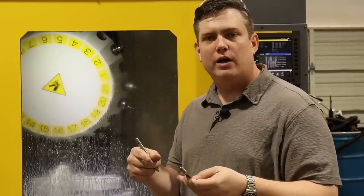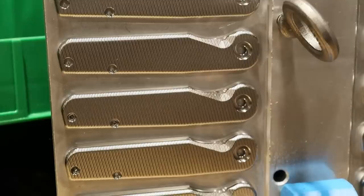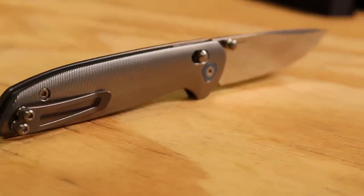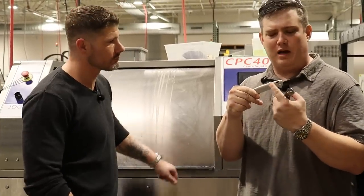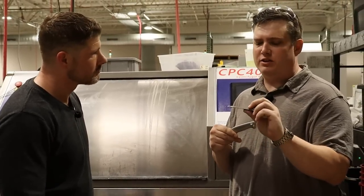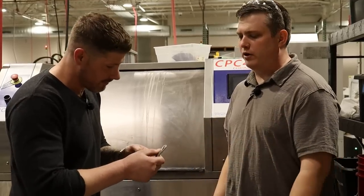This is the machine that's doing that right now — creating a ball end mill and bringing it back and forth across, leaving a really great textured feel. Does this machine also do the contouring? Yeah, it's creating a pass and doing an arc every single move, going up and over, removing material but also leaving that clean finish behind. Now back at the finishing machines, all we're doing is making it so this raw machined handle has a more worn-in, broken-in look. It also feels smoother and makes it so if you use it and it scratches, it doesn't show that as much. It adjusts the tactile feel a little bit, but it's still there — you still feel that grip.